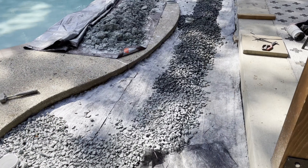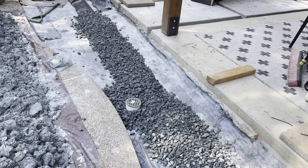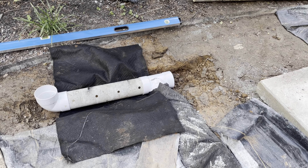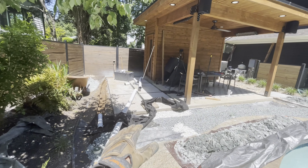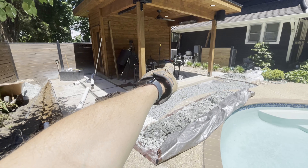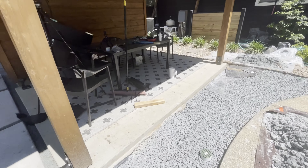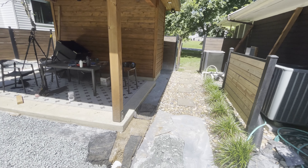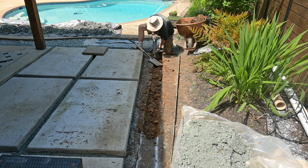I'm starting the aggregate a little high on top so that part is filtered out and the drain doesn't get too clogged. I double-check to know how much of my top layer is going on top. What I actually did was level it from the middle to each side and then towards the back corner. If I did just one drain all the way across 40 feet, I'd have to drop it maybe half a foot to eight inches and dig a lot. But since I have drains on each side, I drain in two different places — each side of the middle drains to the sides and back. So I'm only doing half the distance, which means I don't have to dig as much, and I have a backup drain.